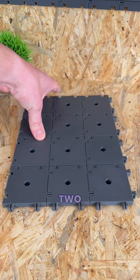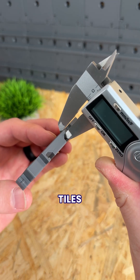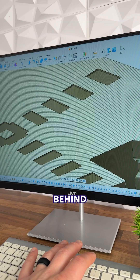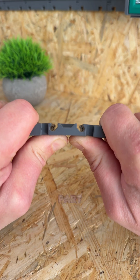And whilst in comparison number two might seem really simple, after adding rail cutouts in the back of our spacer tiles we needed a way to make them way stronger. So we added hollow sections behind each cutout that would print extra walls inside, making them almost as strong as a completely solid part.